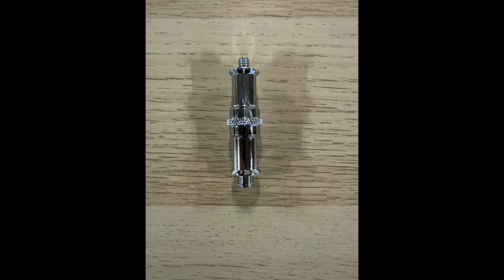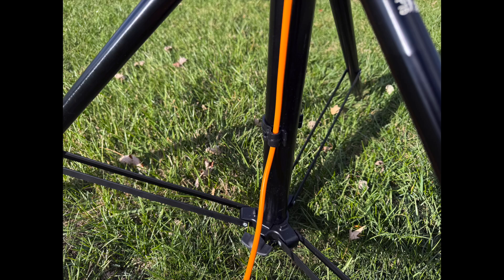One plus for this antenna is that you can rotate it to favor the direction you're interested in. The antenna weighs in at just over 3 pounds, and the optional tripod mast is just over 9 pounds. The optional mast includes a removable stud mount which has 1.25-inch threads on top, making this mast a great choice for other antennas as well. One other feature is the included coax clip located near the bottom of the mast. The MC599 can easily be set up in less than 10 minutes and performs very well on 40 through 6 meters, making this a great choice for your next portable outing.